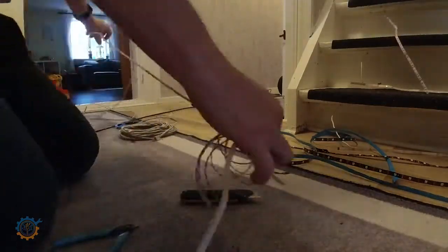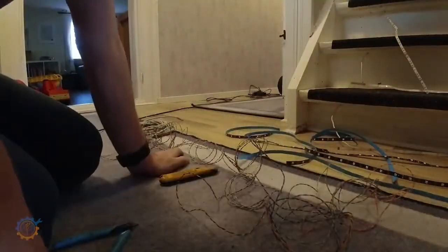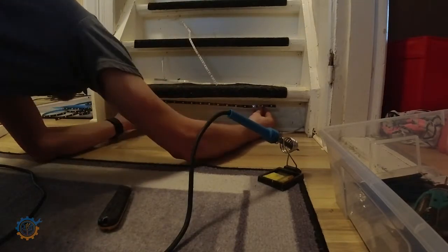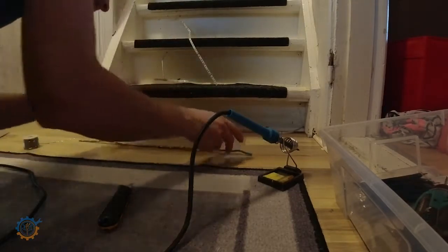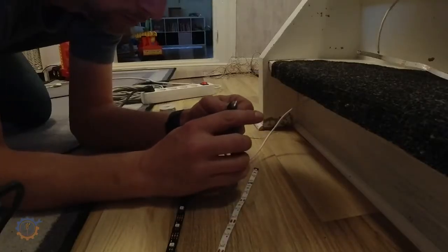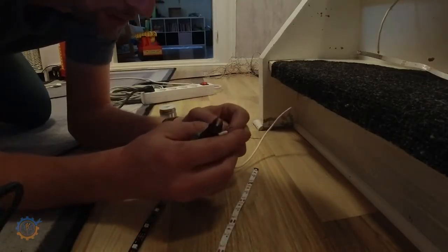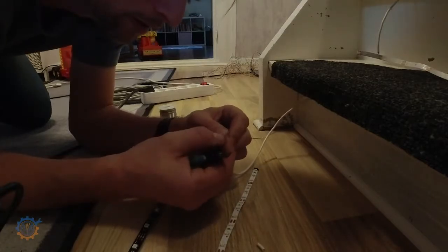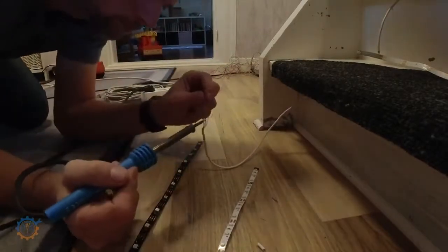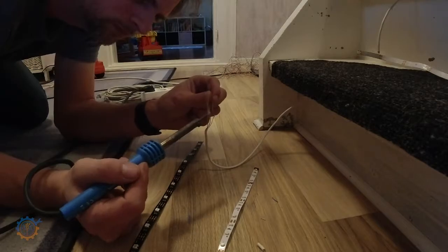Checking out the length so it fits under the stairs. As you can see, the length of the LED strips themselves is roughly the same as the mats on the stairs. I'm now fixing the wires that will be attached to the LEDs. On the first one I need three wires: the power positive, the power negative, and the data line. I'm just pre-soldering everything up so they are ready to go.